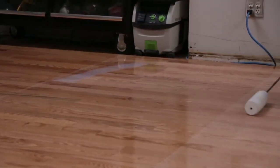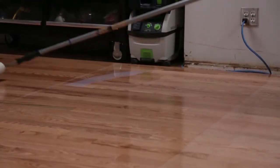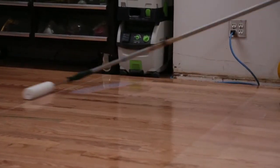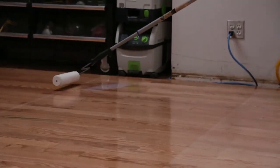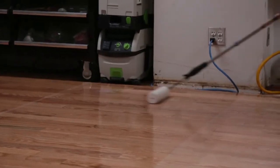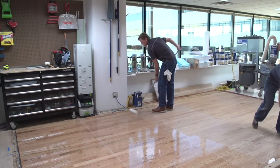Who rolls? Got a couple of rollers. Any different techniques that you guys use? Yeah, we start on a roll, bring the whole patch backwards. We pad out kind of like a T-bar. Okay. Wood, and then before it goes out in the beginning like that, we bring our whole line all the way back. With the grain of the wood. With the grain. Okay. Yep. Doing little sections and feathering out as you go.